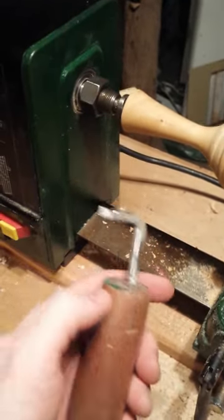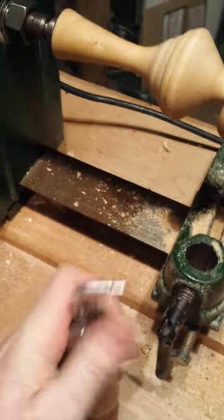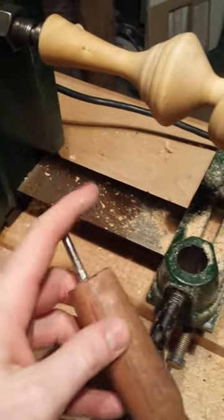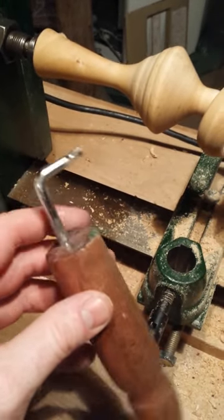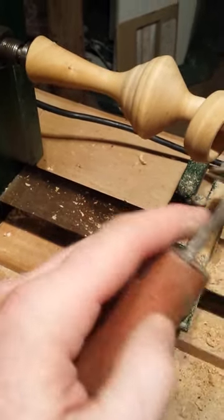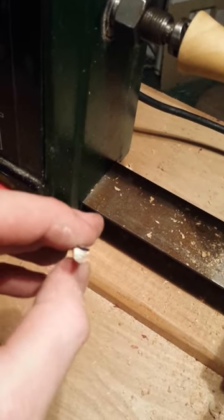I made this tool. I went to Canadian Tire and got myself an angled screwdriver for $3.00. It was two of these shaped as a Z, so I cut it in half. Then I angle grinded the side — I angle grinded this round part flat on two sides to make it square.